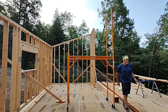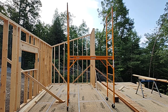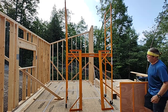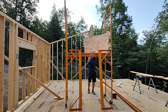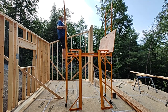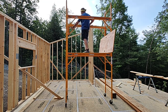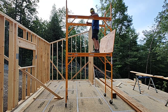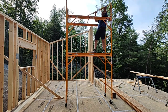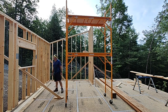Because the walls are going to continue to get taller as we move to the back of the house, I need to get an extra set of scaffolding. I call this baker scaffolding — it's yellow scaffolding that you can stack two or three high. It's pretty cheap, very strong, very light, and maneuvers around pretty easily. When you stack it this high I'll add outriggers to one side for additional security; you don't really need them on the other side because that side is invariably against a wall.